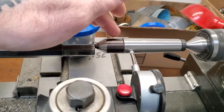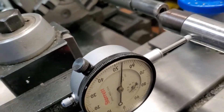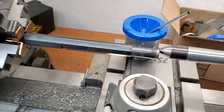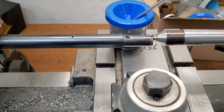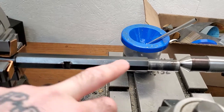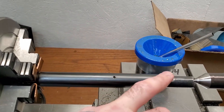Before you get your barrel fully indicated, your dead center will move around and then you know how much to adjust your four-jaw by trial and error. You look at your dial indicator — I had this thing probably within half a thousandth before I drilled the hole. You've got to bounce back and forth: you've got to get the center punch mark centered, but you've also got to make sure that this surface and this surface are concentric. You do that by putting your dial indicator on, sweeping it back and forth, and tapping the barrel around gently in your copper jaws.